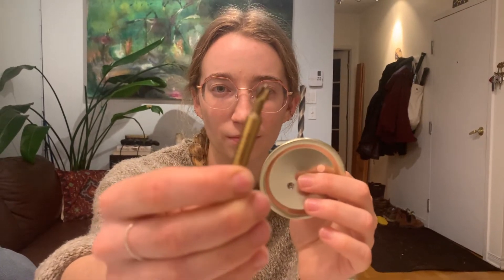These fit in there really well — I'll show you later. You don't need to cement them in with any silicone or anything. The smaller hole is made with a 13/64th metal drill bit. You can also use a brad point bit that has a little pointy tip — that's usually for wood, but since it's such thin, flimsy metal, it's okay and makes it a little bit easier. The syringe filter goes in the smaller hole. This is 25 millimeters in diameter with a 0.22 micron pore hole size, and you cement this into the smaller hole with high-temperature silicone.